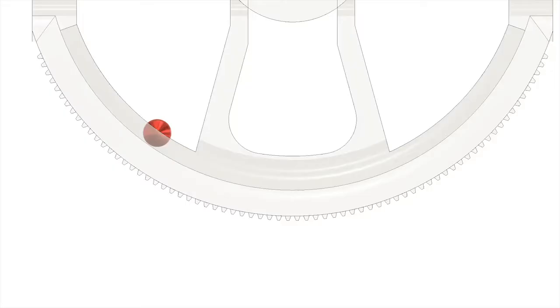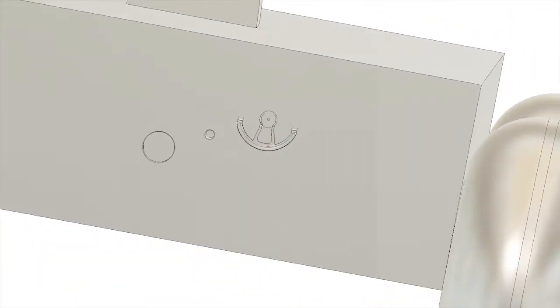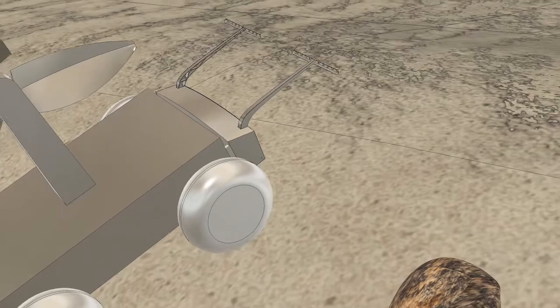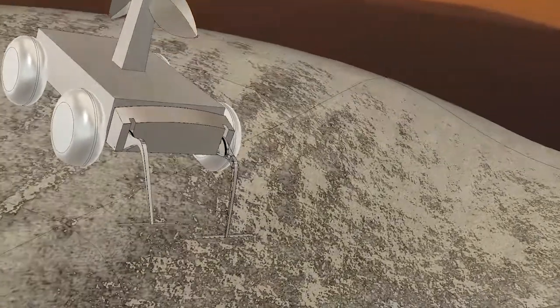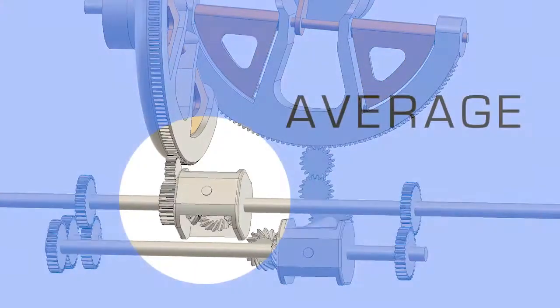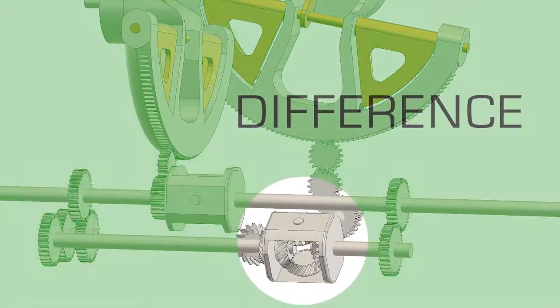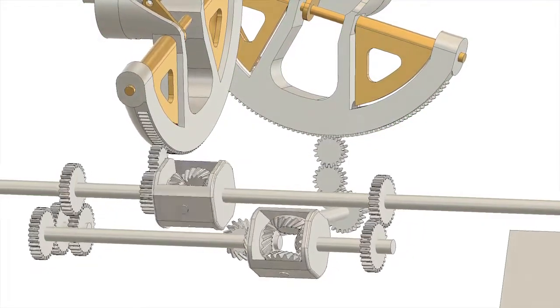Here's how it works. The heart of the Roach system is a simple rolling ball clinometer that works with gravity to read the pitch of the rover as it moves along. Roach uses two clinometers — one for forward-back pitch and one for side-to-side pitch. At regular intervals, about every meter of travel, Roach's antenna-like probes tip down and touch the ground. This tells the system the precise angle of the terrain relative to the rover on the left and right side of the rover's path. By averaging the two probe angles, Roach knows the forward-back pitch of the upcoming terrain, and by using the difference between the two probe angles, Roach knows the left-right pitch of the terrain.